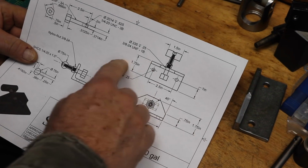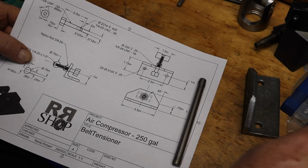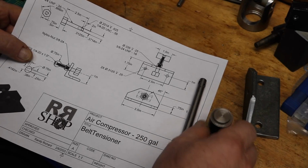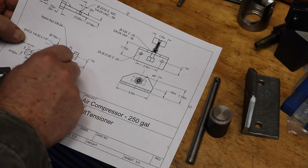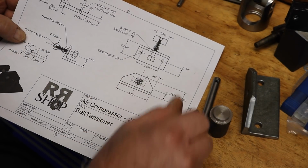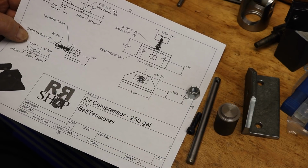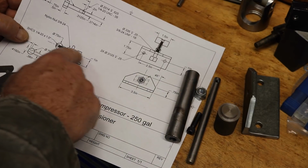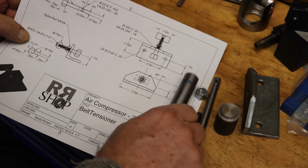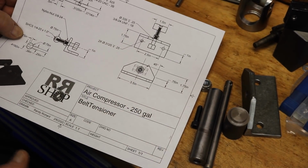And we'll build a screw for it right there, 3/8-24 stock. Stock for the hex part. We're going to be able to make it out of 2 pieces. We'll attach it with a 1/4-20 socket head cap screw, attach the head so it swivels. We'll have a lock nut, and then we've got some 3/4 stock here, and we'll make the little shoe out of it, out of the 3/4 stock. So right there. So we'll continue on and get all the rest of the parts made.